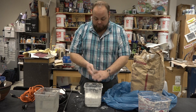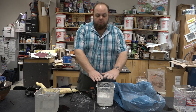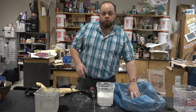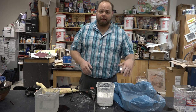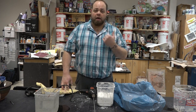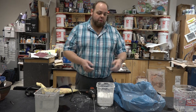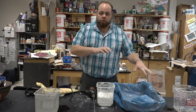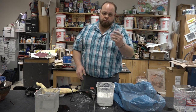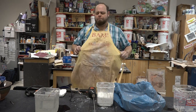At this point I've got my drill set, my plaster ready, and my bin off to the side. I've put the bin inside a plastic bag — that's the release agent. This bin is plastic-esque; it might or might not stick, but I want that security. You can also line it with saran wrap as a sling — once the plaster sets, pull the sling out. Plastic wrap works fine too. I'm wearing an apron since this can get messy.